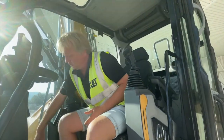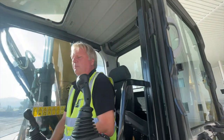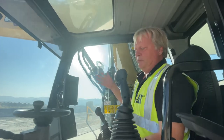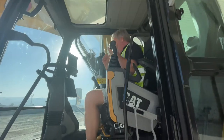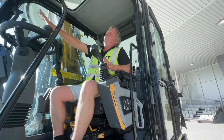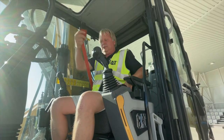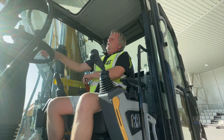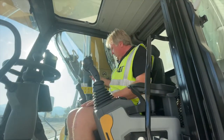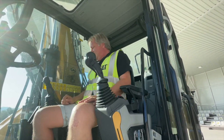I have a lot of glass going completely to the bottom, giving me a good view to the right side, to the front, to the left side, and to the back. The machine is equipped, as an option, with four cameras providing a 360-degree bird's-eye view — easy for safety because in tight worksites I can see everything around me, especially what's behind me. These are special joysticks with a lot of buttons for my tilt rotator, and if I have a normal bucket on, I can have different joysticks. The seat belt is very important — if the seat belt is not on, it will give me a signal on the monitor. Also this excavator is keyless — with a code, a Bluetooth key, or even your iPhone, you can start the machine or put the electric on.